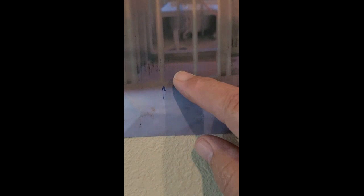What I'm going to do is take an area right between these two studs and cut a little square opening, going a little bit past each stud. That way, if I find it's not what I think, I can put the patch back in, screw it to the studs, fill it in, reapply the texture, paint it, and you'll never know I was here. But I'm pretty sure there's a good recess back there, so I'm going to make a little hole, take some measurements, and figure out how I can get the arched opening.